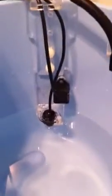Okay? Now, unless there is some sort of safeguard with this Fish Street system, I'm not sure at this stage, because I've only been testing it for a short time, and I don't know if this top sensor is how it operates, because I've been told by one of the guys at Fish Street that this is all normal operation for the water to come up to the second sensor. But as you can see, the second sensor is well out of the water now, and it is now operating by the bottom sensor. Now, I'll take more water out again.